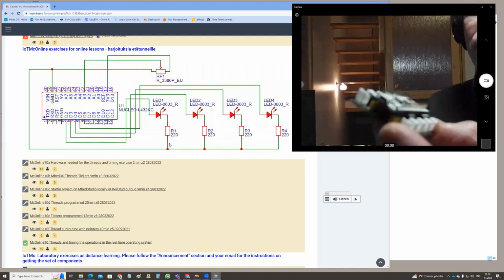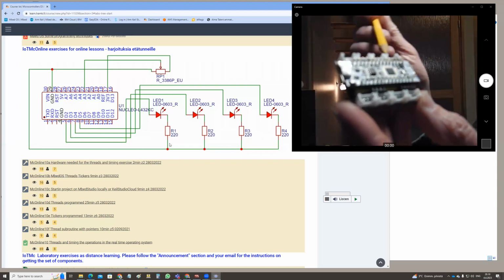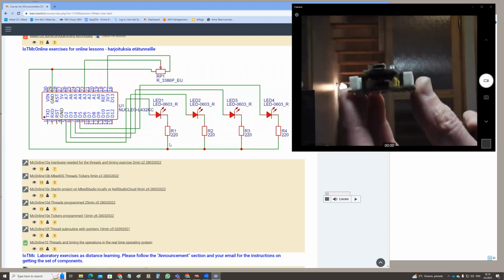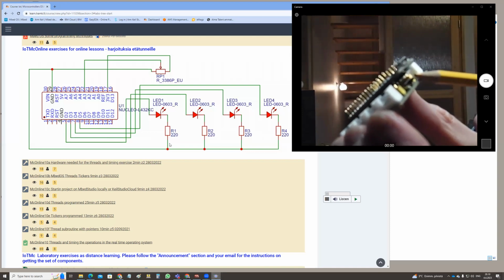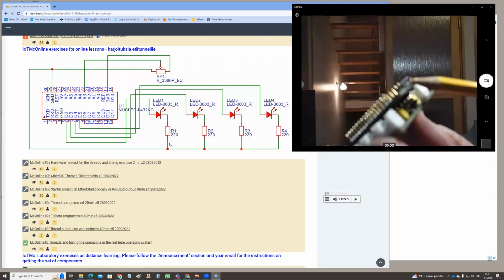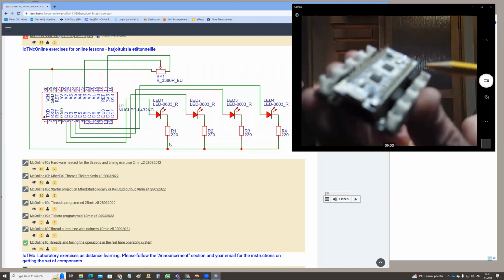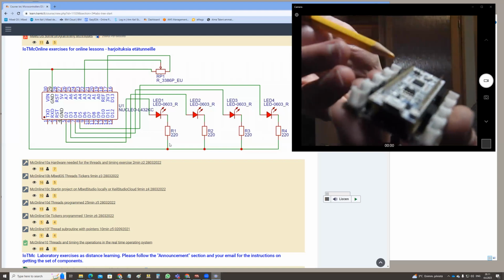You might have your microcontroller on a board like this. So that's a board with always 4-pin sockets in here for different sensor circuits, or even output circuits. You need to connect the microcontroller there in the way that you see there is a small switch in here. The switch is on the position 3.3 volts, and then you just put the microcontroller there. So the USB is on the same end as the switch, then it's the right way round. And it's the right way round when you will get your wires on the pins D9, D10, D11, D12, D13, and so on.